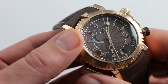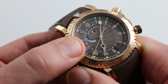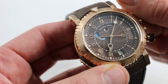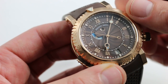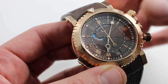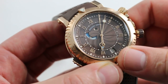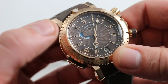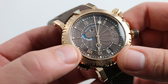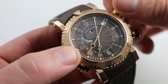Once the alarm is fully wound, you'll note that as the alarm discharges, so does the power reserve indicator. This crown has other functions too. In its second position it can be used to quick-set the date at six o'clock — remember never to attempt this between 8 p.m. and 3 a.m., as that's the period during which the movement's automatic date jumper is engaged, and attempting the quick-set while the date jumper is engaged can damage the movement. Finally, in its outermost position, the movement has a hacking function or stop seconds, which halts the seconds hand so you can synchronize to a known accurate reference time such as a dive timer or an online atomic clock. The hands can be moved and set precisely, and they are beautiful rose gold Breguet-style hands.